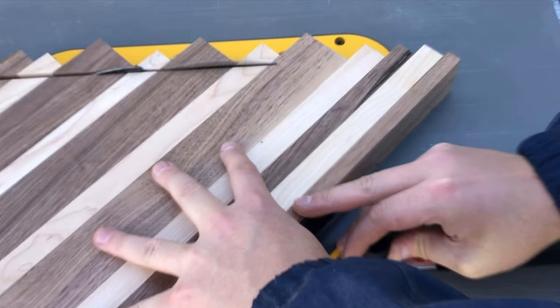So whenever I was making this 45 degree cut, I had my camera mount attached to the table saw, and whenever I started the table saw up, the camera footage came out all shaky. So I'm just showing a screenshot here, but you can see I'm running this through the table saw using the jig that came with the DeWalt table saw that allows you to cut at a 45 degree angle. And after I had that first cut made, I used the fence to reference against that edge to create the 1.5-inch strips from there on out.